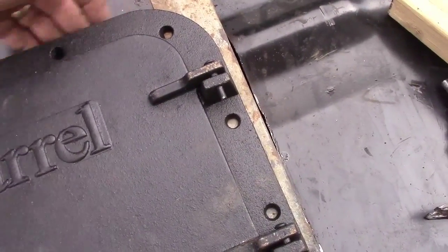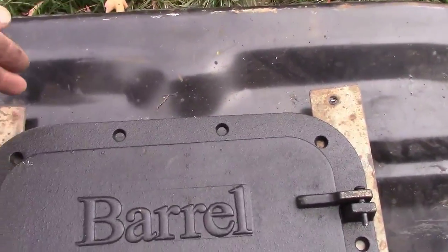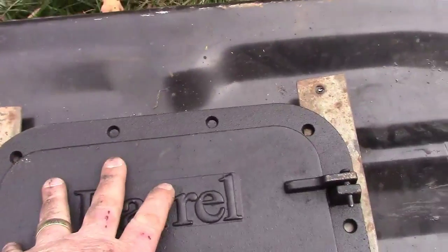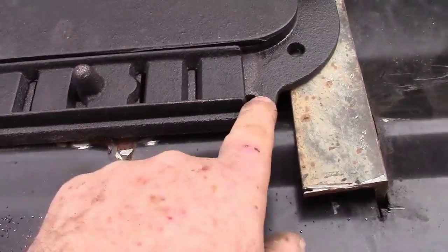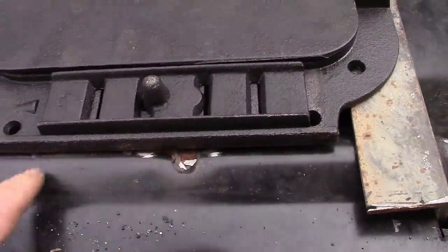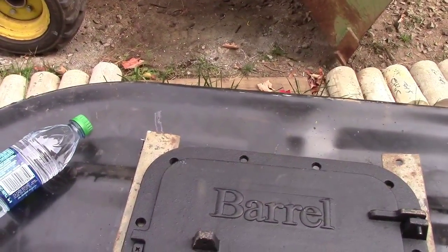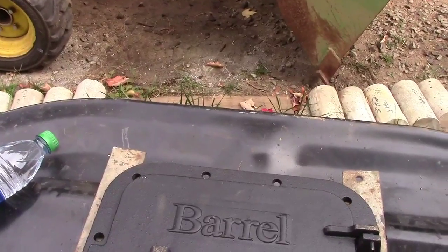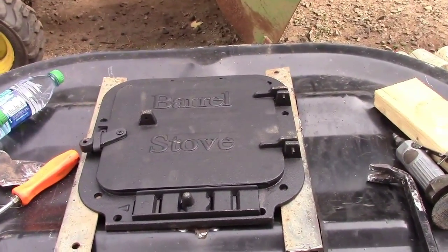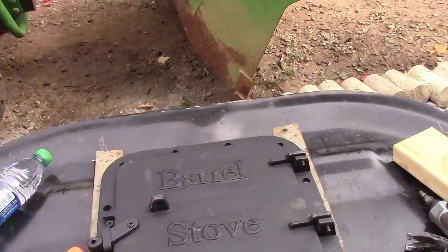Actually, I'm going to have to put a channel in the back here, like I did with the sides. But down here, since it's so close, I can just put a piece of flat stock, just enough to cover and bolt in. Then I've got to open it up and cut out the inside, get the old MIG out, and start tacking it in place. That's where we're at so far. I just have to tilt it just a little bit and get that cant corrected.